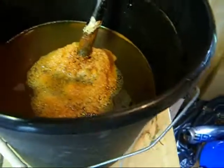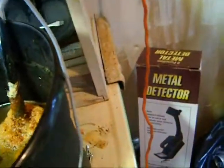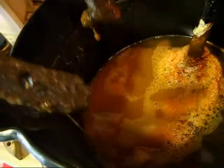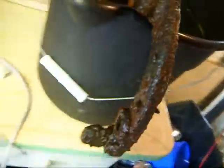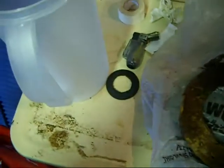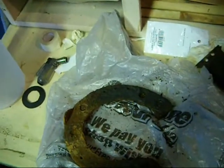It's been overnight. I'll disconnect and pull it out of the soup — damn that sucker's heavy. I'm going to let it dry off for a little bit, then come back and hit it with some wire brushes. Typically first I take a coarse brush and go after it, then take a finer brush — this happens to be an old barbecue brush. I'll do that for a few and show you.